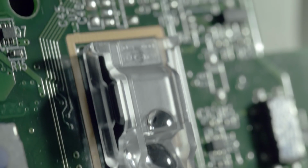It's starting with the number of components we put on the printed circuit board, because the fewer components you have, the lighter the mouse is. This meant in the later stages we were actually literally just cutting away parts of the printed circuit board.